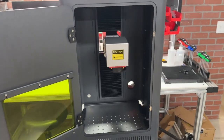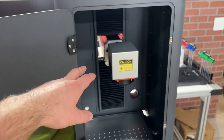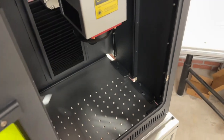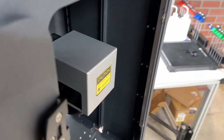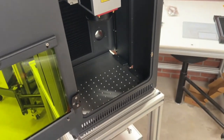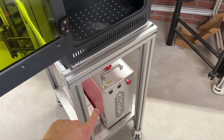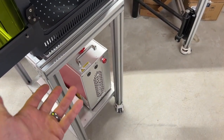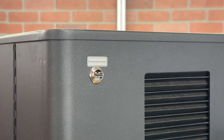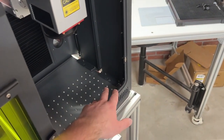At this point, all that's left is to slide the cover on top of the laser and attach the accordion covers to the laser head. In addition to the door switch — located down here on the enclosure — there's also a built-in light along the front. One thing that's a bit of a bummer is that the light is wired to the same plug as the door switch, so in order for the light to get power you need to wire up the enclosure harness to your laser source. If you're electrically savvy you can create your own harness to provide 24-volt power to the light. I still wish Cloudray would include something like that for people who just want the light to function without wiring up the door switch.